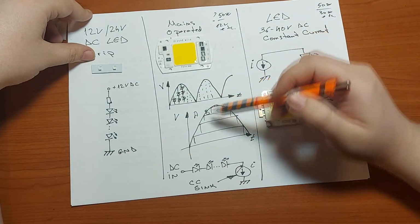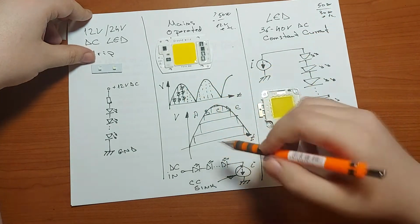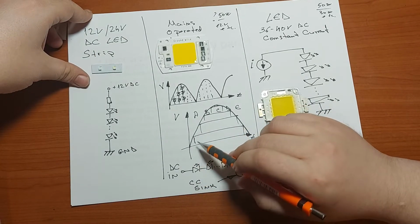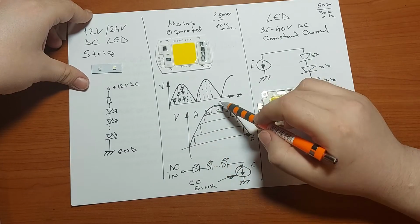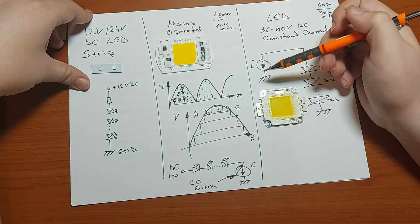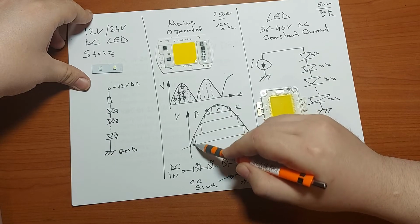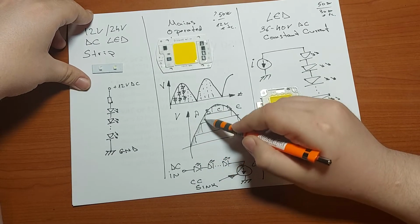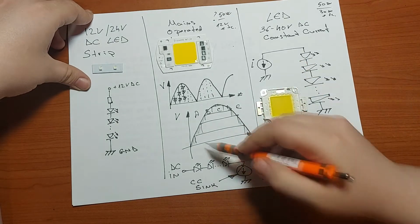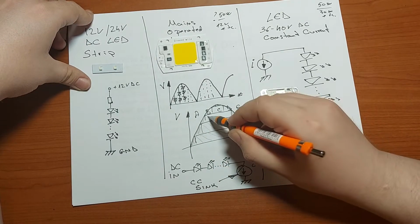So these LEDs are calculated and connected in series in such a way that as the rectified but unbuffered raw mains voltage rises, so does each block of LEDs turn on. So the wasted power is only this small slice of all the input power, and this slice is fed actively to the LEDs.